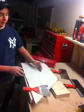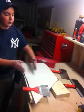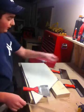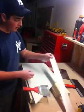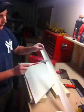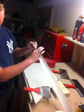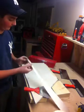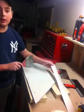I must remind you that these aren't going to be this small. The joints will stretch as far as the drywall is going. So you will have a continuous piece of tape going along the seam. This is just a small example. On the tape itself, it has a little line going down. This is good when you're doing corners because you can fold it in half like this, and it's what we call pre-crease tape.